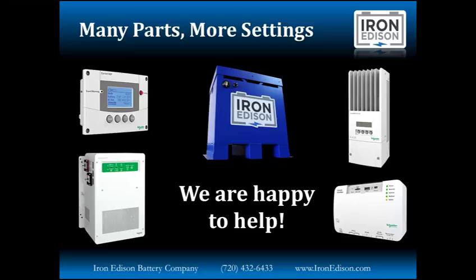Internet access, as we said earlier, the CommBox will phone home, as we say, and upload its data. It's a read-only upload to Schneider's servers, and then you log into Schneider's website just to monitor the performance of your system. You can't make any configuration changes in this method. The only way you can make configuration changes via the CommBox is on the local network.